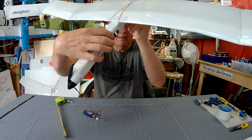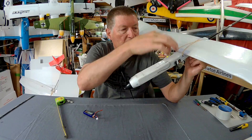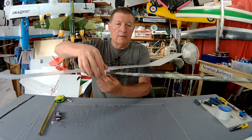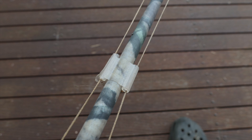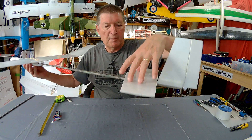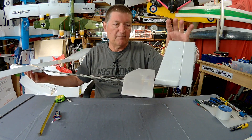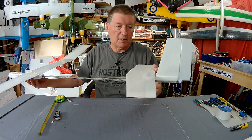The servos lie flat on the side on the ground — not the most aerodynamic, but you could mount them internally and run the pull lines down the tube for a more aerodynamic result. These are Kevlar kite lines, though any thin Dacron line would do, running through little tubes taped on and back to ID card plastic control horns. The rudder and elevator are just 3mm Depron covered with iron-on laminate or packing tape. The 3mm Depron vertical stabiliser wasn't strong enough for slope soaring and had to be changed to balsa, but it's fine for a gentle thermal glider.